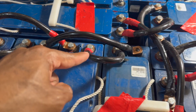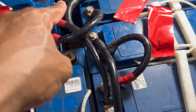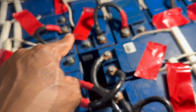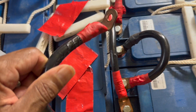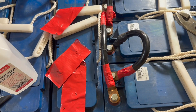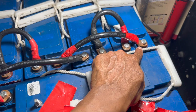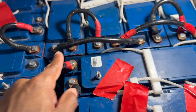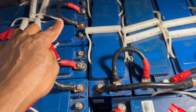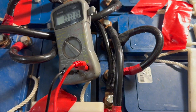I've got to tie all these four to these right here, and tie these four to these, and then connect all of these together in parallel — positive and negative. I just hope I have enough wire. Okay, I've got these four batteries hooked in parallel, positive to positive, negative to negative. Now I'm going to jump these next four in parallel.